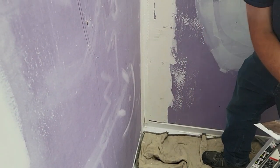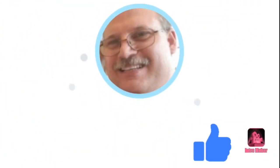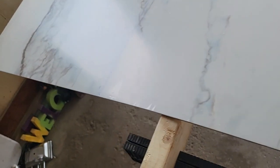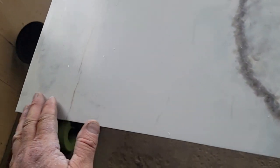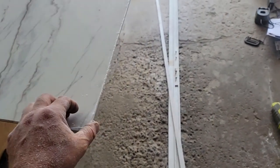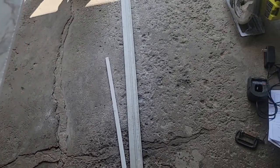I'll put another bead in there so we can mush it, and I'll show you what it looks like in a minute. So here's our flex stone — it matches the floor tile really well, it's got a protective coating, it's about a quarter inch thick. Pretty expensive stuff. They want you to do a center line and measure left and right in case you've got variables, and you cut it to that. I cut it with my circular saw — did a pretty nice job — and then I used an eight-foot straight edge.